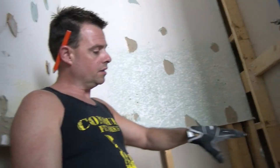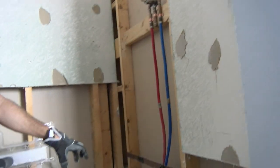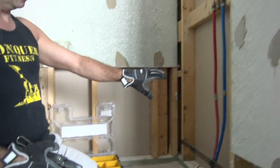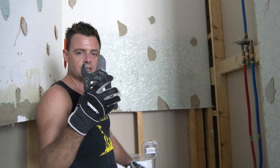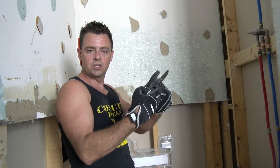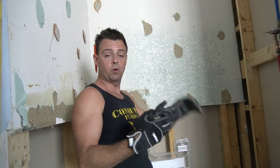What we're doing this morning is day two of the bathroom remodel. We're taking the old shower and basically converting it into an exterior walk-in coat closet. What I'm doing this morning is cutting the piping. We're going to cap the piping off in the wall and cap the piping off on the floor. This is PEX piping — it's not your typical copper. I'm using these really cool cutters. One of the most simplest jobs is PEX. You cut it, crimpers go on, it crimps, you're done. There's no sweating involved, no flux, no heat, no anything — it's a really cool process.